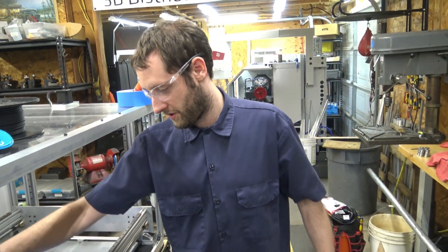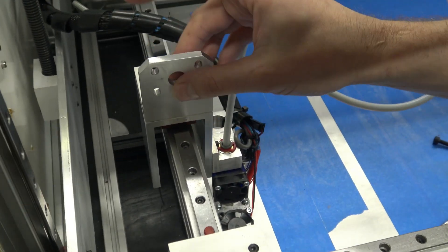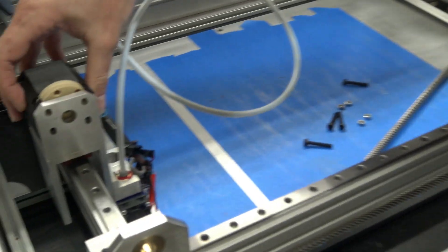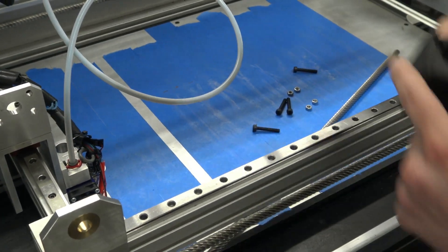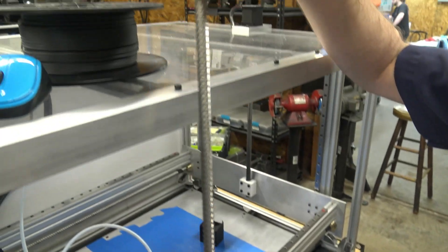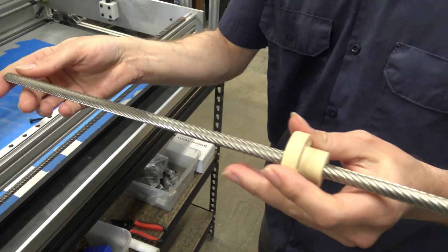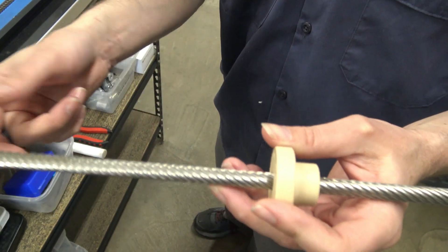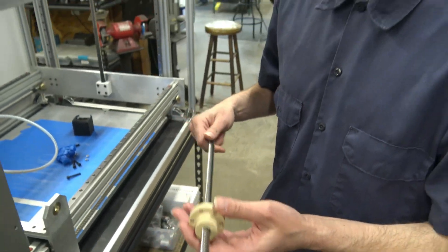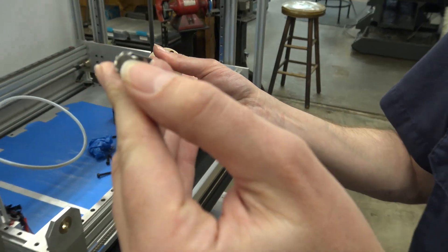We made this new Y-axis lead screw nut mount that moves the carriage — this was 3D printed before, but now we made it out of metal. This is the lead screw nut. The motor makes one revolution and it moves 50 millimeters — that's almost two inches of travel per revolution. This is what makes our printer so fast and accurate: we use these special high-helix lead screws. If you look at it, it's got 12 threads on top of each other.